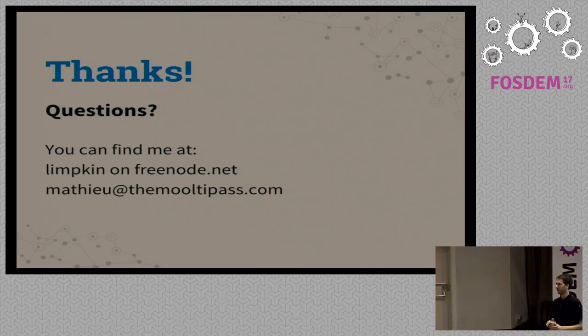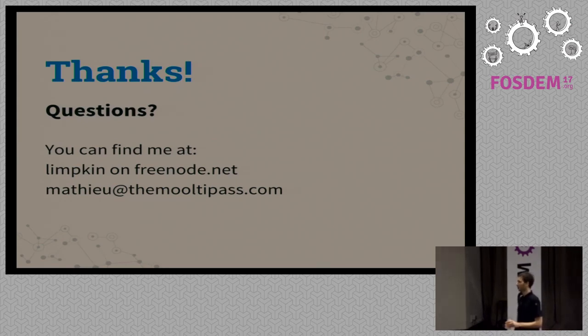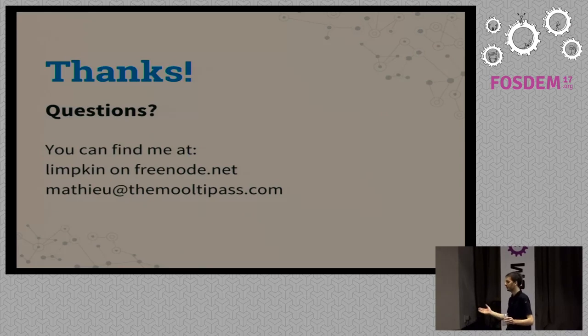Secure. So the security of our device relies on its physical integrity, right? So we know for sure, because of the firmware we have flashed, that the firmware has not been tampered with. This is a guarantee we provide. So the only attack that could be done during the manufacturing process is to implement a sniffer in the hardware itself. But most of the units will go through Switzerland, where I live, and I will disassemble some of them. So actually, this could be easily detected. And even if there was a sniffer, the case is made of aluminum, so it might be a bit tricky. It's not a perfect Faraday cage, of course, but at least it's something. And the tolerances are quite tight, so the sniffer you would have to put there would be quite small.